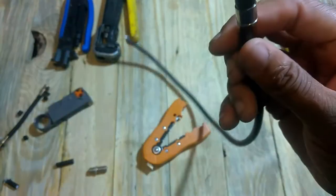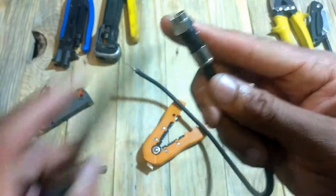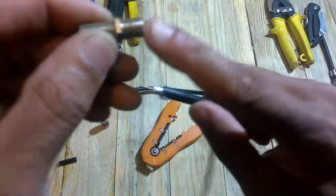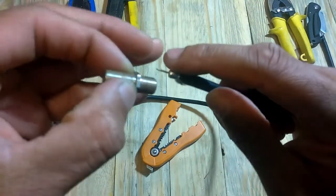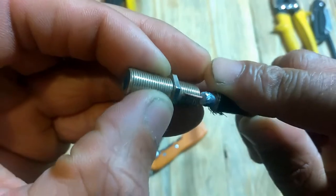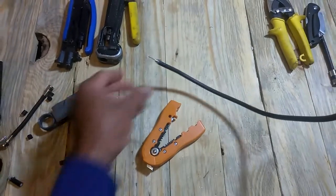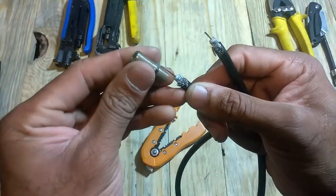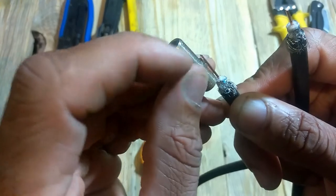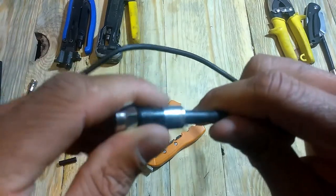You want to make sure that your stinger is about a dime's width above the top of the connector. Because when you think about it — this is your television port or whatever box you're connecting to — that stinger is about the right length to go into your television or whatever device you're connecting to. That's the perfect length. Anything longer, like this example here, you jam it down there and that extra portion is all up in your TV messing everything up. So just make sure you have everything lined up, get that on there, make sure it's flush.